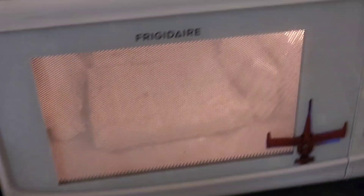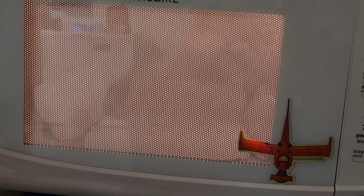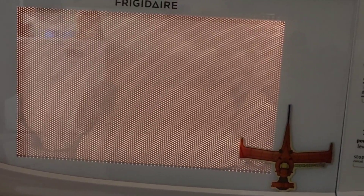Wish I got that on camera. Just to verify — I've used this setup before, so I wanted to see if there was something different with this piece, or maybe something had gotten onto the wool blanket. As you can see, while it's running without the crucible, there are no arcs forming, which is definitely not the case when the crucible is present. I'm wondering if my different composition has an effect, or perhaps even the cylindrical nature of these crucibles. It's something with the ceramic wool — let's stop that. We'll be switching to a standard non-coated piece of ceramic blanket.